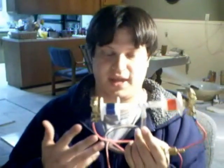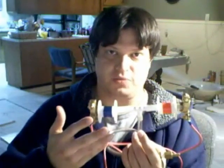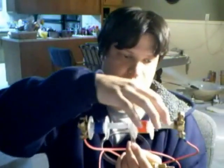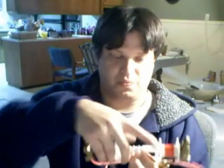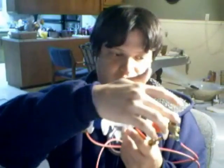I made this little device when I first started experimenting with ionized gases, with gas tubes. Basically what it is is a homemade vacuum tube, a discharge tube. On each end of the tube we have an electrode that's sealed, and we also have another tube here with a valve. What we do is hook this up to a hand-operated vacuum pump and pump out the air from the tube, then connect the electrodes to a source of high voltage, and what ends up happening is we get a bright purple stream through the entire length of the tube.